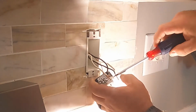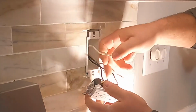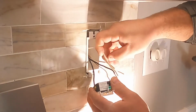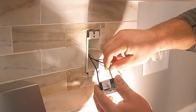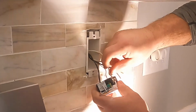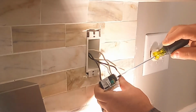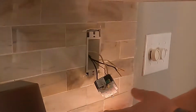And so when you have high current going through this particular device right here, from this device to the next device downstream, if the termination fails, it could start a fire. It's as simple as that. The circuit breaker is not going to see a fault condition, so it won't trip on that condition. But it'll eventually just sizzle away and arc away until the connection breaks, which I've seen, unfortunately, too often, which is probably why I'm there replacing them to begin with.